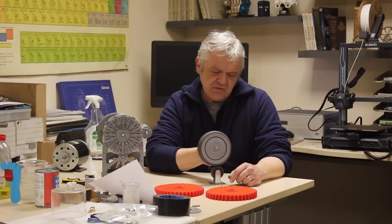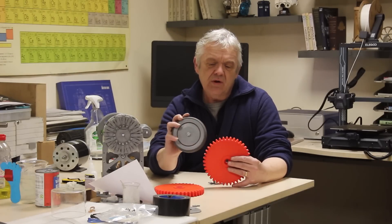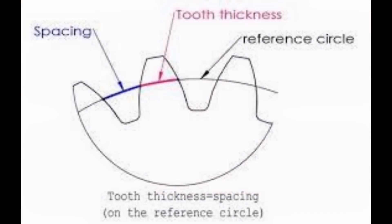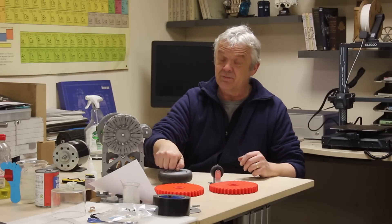Because they're wheels, any force on them will cause slipping. So what we do is stick some teeth on them — the minute you do that you've got a gear. If we stick the teeth straight on the edge the gear ratio will shift, but if we stick each tooth half out and half in we'll keep the same wheel ratio and the gears will still mesh together. That circle is called the reference circle — the circle we use to place the teeth on.